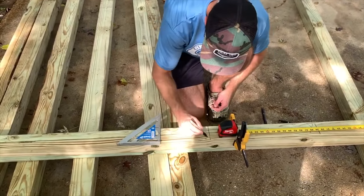After completing the last row on the shed, I went down to the underside of the shed and I scored off the excess with a utility knife so that it was flush with the fascia board as you're seeing right now. After completing this step, it's time to install the ridge flashing, which will cover up that last row.